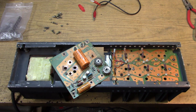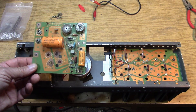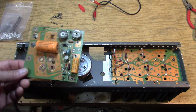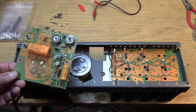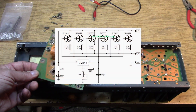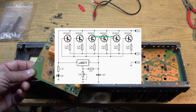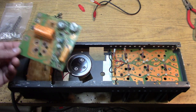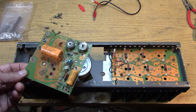I am not going to try to repair this power supply with the 723 circuit. I want to do something a little simpler and a little more modern for a 28-volt supply. I was looking on the internet and I saw a few different diagrams using the LM317 generic 1-amp adjustable, and I just wanted to strap some 2N3055s or something like that on. But I really would like some current limiting here too, not just a fuse that blows up when I go over 10 amps. So I'm going to attempt to do a current limiter as well.